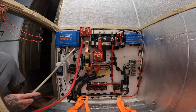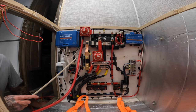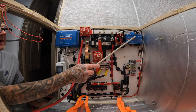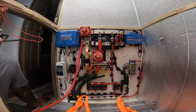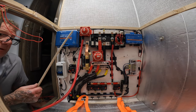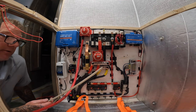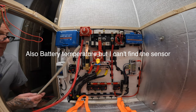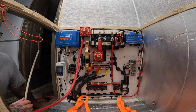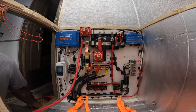Right where it says PV is the solar panel input, and off of here it says 'to batteries.' From the solar panels it goes through a breaker into the MPPT, then down through a 30-amp breaker and right onto my positive bus bar. The negative side of my MPPT comes around and is bolted onto the load side of my shunt — not the line side. There's only one wire on the line side, and that goes to my battery. This display box will tell me how much power is coming into my unit, how much is leaving, what condition my batteries are in, and when they were last fully charged.